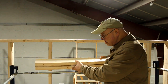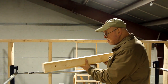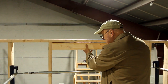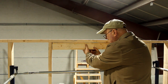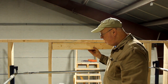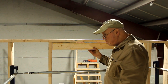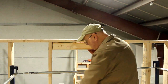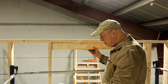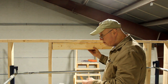The header is not a 2x6 — it's a 2x4 header because the window needs to go up as high as it can, and it doesn't need a 2x6 header because the top plate is right here and this header is going to go right up against it. Even though I did this in CAD, real-world measurements might be a little bit different and I might have to make some adjustments.